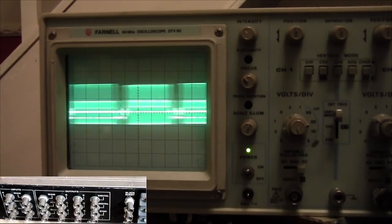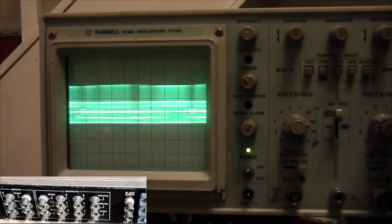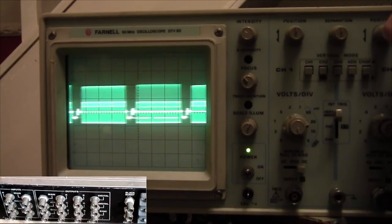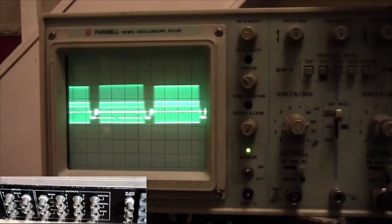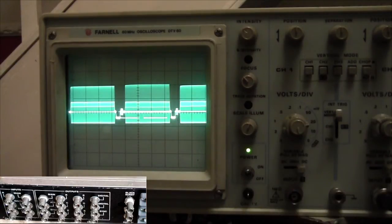Beautiful oscilloscope stuff. No, come on. I'm keeping this live so you can actually see how bugger it is to trigger stuff sometimes, which just means how bugger it is to get these images stable. Okay, there she is. There's the auxiliary. I'll twiddle that a bit. Oh, got it locked. Okay, right. Look at that. Beautiful auxiliary signal. 1, 2, 3, 3.2, 3.5 pulses long.